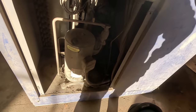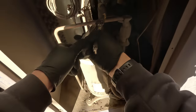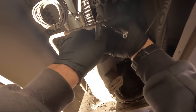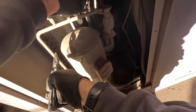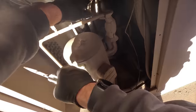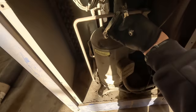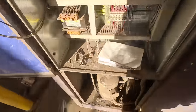We've got a discharge port on the front and they had tape wrapped around the threads. Generally I don't like these screw-on type caps on the discharge because they usually leak. Somebody over-tightened it, which usually makes it worse. I'm getting leakage on that — either that Schrader core is missing or the valve core is bad. Either way that's going to leak. That type of cap will not seal.